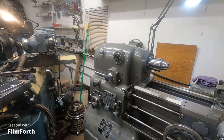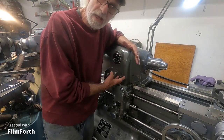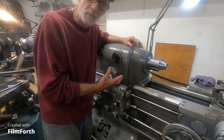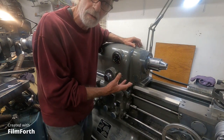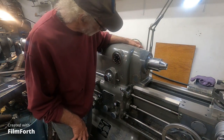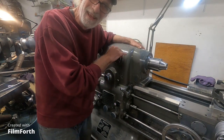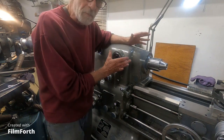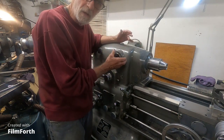Running in reverse at about 500 RPM. This has got an ingenious oil system. This is a later one with a single oil window headstock, and it circulates the oil. The older ones had windows at the bearing locations and the bearings sit in oil. This one circulates it without a pump — something more ingenious. It uses the tachometer drive gears and the oil climbing up on them; there's a little trough that scrapes the oil off and then it goes to the bearings. It picks up more oil running in reverse, so that's why I run it in reverse for a while.